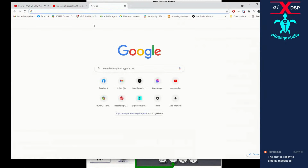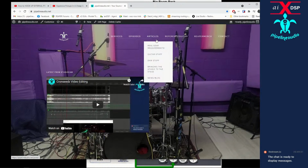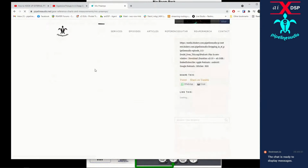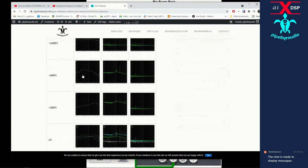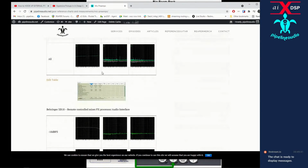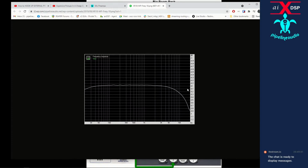You know, if we actually go here, and when we actually look, and I mean zoomed in to like the 1/10 of a decibel. I mean, this is like a 1/10 of a decibel we're looking at here. That's a piece of crap right there. But here's a cheapo Behringer, flat, no distortion, not much noise. The newer Behringers, they're still just as flat. This looks not so flat because, you know, it's scaled in so much. But if you look, that's 1/10 of a decibel, and it's almost a decibel down between 10K and 20K. But still, again, that's nothing.